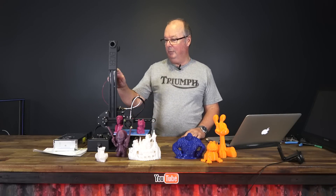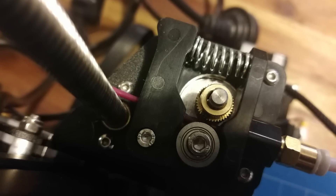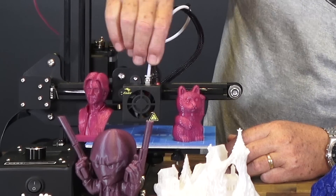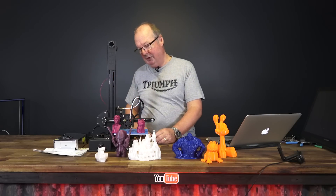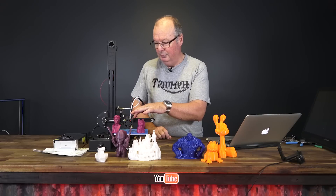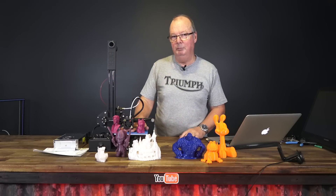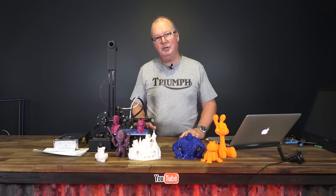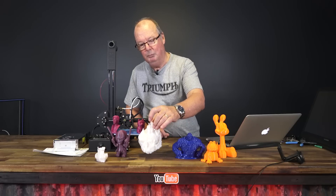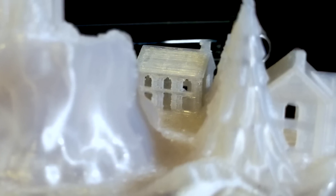It's got a proper trapezoid lead screw. It's got a moulded extruder. We've got one of these enclosed hotends — it's a cloned type hotend. There is no print fan on this printer, but the fan that blows onto the cooling fins of the hotend actually does create some draft underneath. So for PLA, probably just enough. There are some examples here that show very fine detail. As far as cooling fans go, it's adequate.